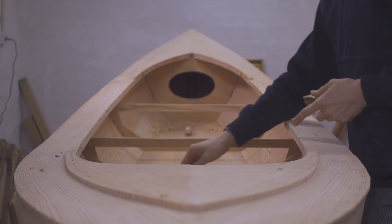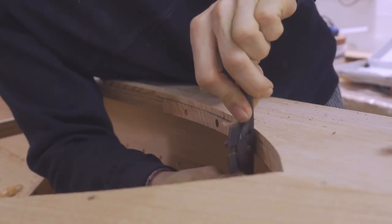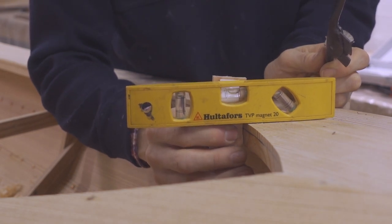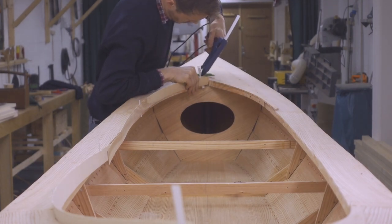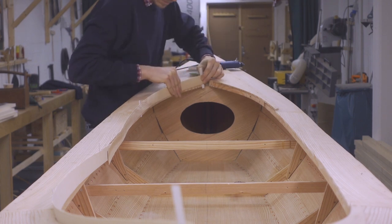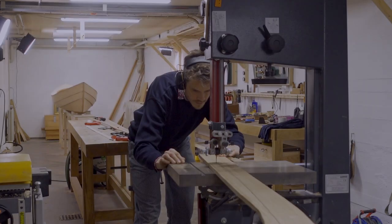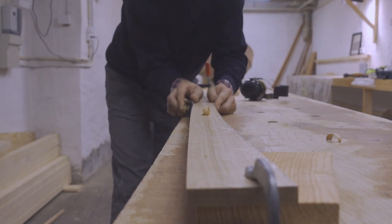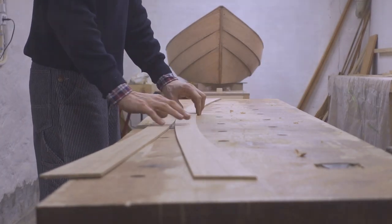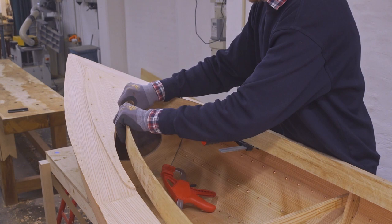Now I'm ready to start working on the coaming. The coaming should lean out a bit so I need to bevel the long carlins and the coaming support knees, especially towards the ends of the boat. I'm using a shop-made contraption to see how much wood I need to remove. The shape of the coaming sides is described in the plans, but I decided to make a pattern for it anyway. The process of making this pattern is very similar to the plank patterning process. Then I draw the shape of my coaming side, cut it out and plane it to the line. Once the shape is good, I split it on the bandsaw to get two identical pieces. The coaming sides take a sharp bend at the ends, so to make sure they won't break, I'm giving them a few minutes in the steam box before I install them.